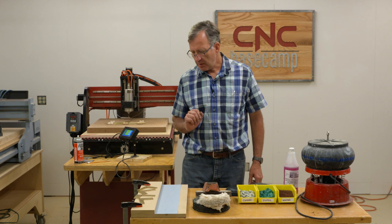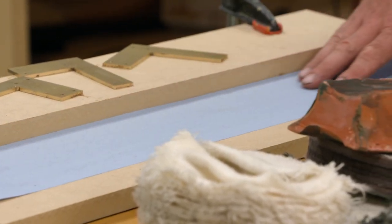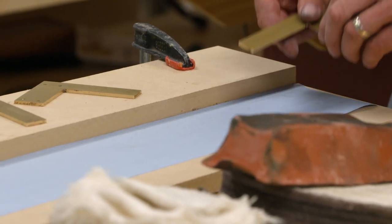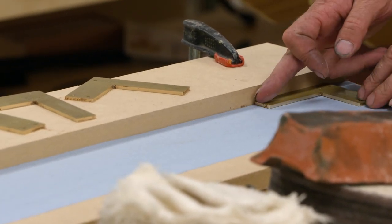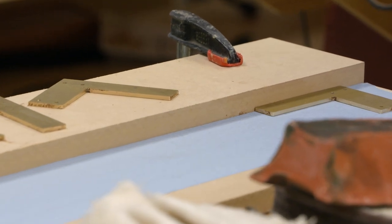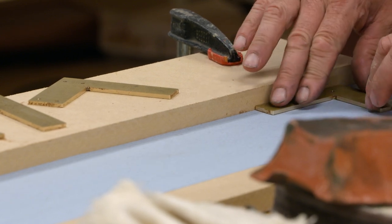The first one I want to talk about is to use abrasives. What you see here is a fence, a flat board, and a piece of PSA sandpaper. You can start at any grit. What we want to make sure is that the striations that the grit leaves are all uniform and in line — that will make for professional looking work. That's why we have the fence.